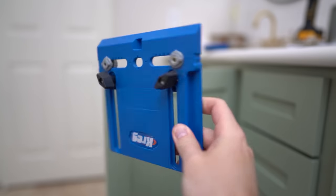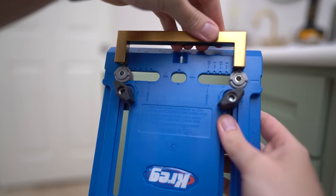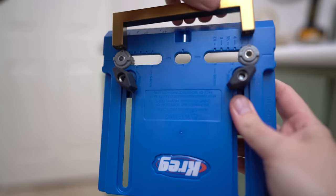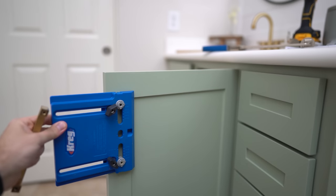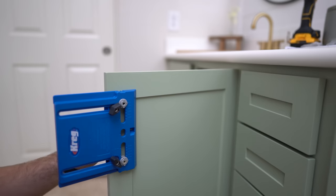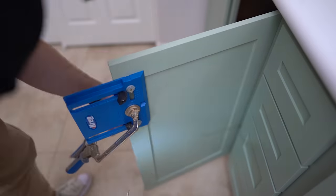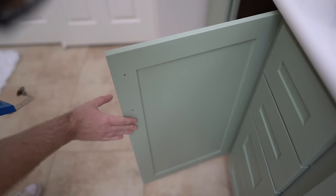You can make your own jig for cabinet door pulls, but I'm using the Kreg jig for this — it worked perfectly. You can set it up exactly to the distance for your hardware, figure out where you want to lay it out, and find a marking to reference next to the top rail. Clamp it in place, drill straight through, pop it off, dust off any debris, and then install. Easy peasy, lemon squeezy.